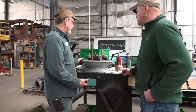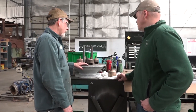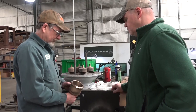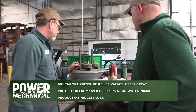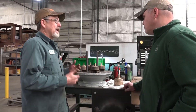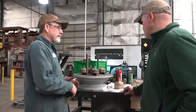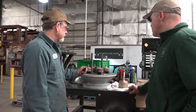It's actually a type of relief valve and we haven't had any luck getting parts on them, so we're having to make a lot of the stuff for it to try to get the customer back up online. We've done machine work, machined the seats, and we're lapping the other seats. It keeps the relief — it protects the relief valve from lifting all the time. When the pressure comes up, these will start opening and slowly relieve the pressure instead of popping the relief valve and dumping it back to the system.